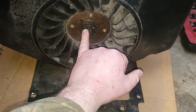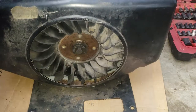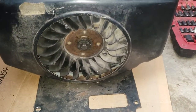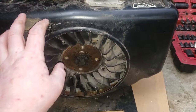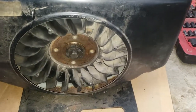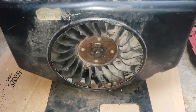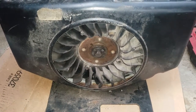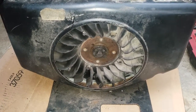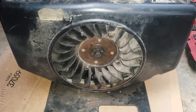So as you can see I've got this off. Next I'll break this nut loose right here, then proceed taking off all the tin around it and get my puller on here and get this flywheel off. This is just a quick how-to — not an exact step-by-step tutorial. Really all you need is a nine-sixteenths and a half-inch socket to do all this. An impact definitely works nicely since these bolts are tight and they are meant to be very tight, as this drives the entire tractor.